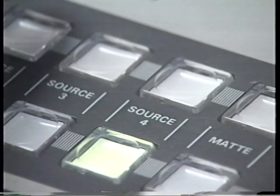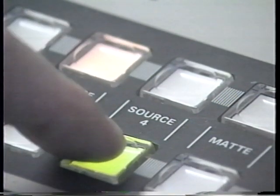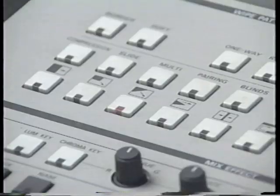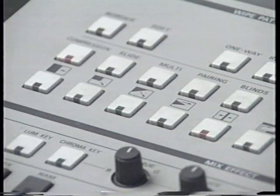Here's a nice effect that puts three compressed pictures on screen at once. First, record onto a Submaster tape two sources from two VCRs while the MX-50 is in the double compression mode on a straight, vertical white pattern. Now play your Submaster back through the MX-50 while assigning it to one bus and a third video source to another bus. This time engage the split wipe pattern along with the compression so that your two picture Submaster tape has the third video source compressed in the middle of it.